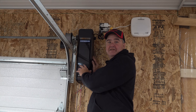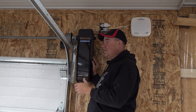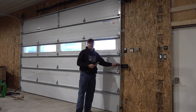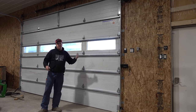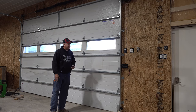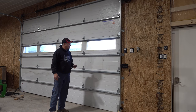I'm sorry we did the travel and pressure adjustment off camera — we were on a support call. To adjust travel: press and hold the adjustment button until you hear a beep and the up button flashes, then hold the up button until the door reaches the desired up position. Press the middle button again to switch to lower, press the down arrow all the way down, then press middle again and go up once more — just press and release — and it sets the pressure needed to lift that door. Once we got the door to move, it made perfect sense.